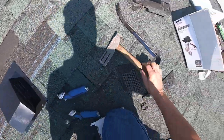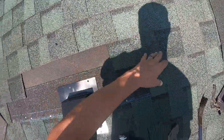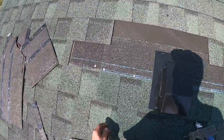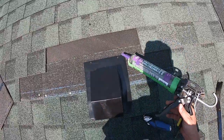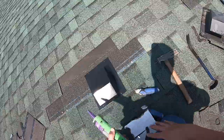Don't put any nails right around the edges or in your keyway areas — at least try not to if you can. Then for caulking: just because there's a little GSL left in here, it's fine. You want to make sure the seal you're using is not going to hurt the roof. Go under the flange, down the side, under the flange, down the side, and maybe a small line here — but leave an area where, if there is water, it could trickle out.